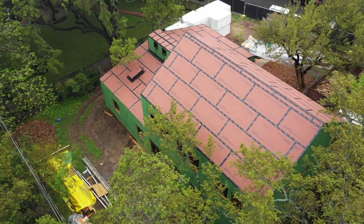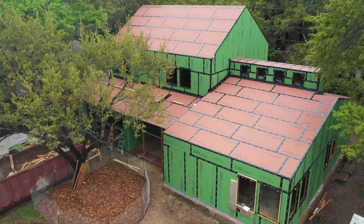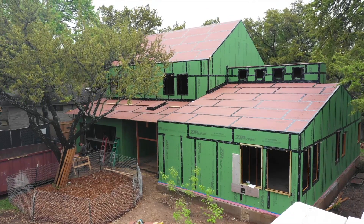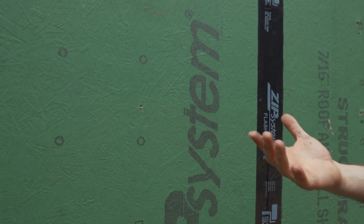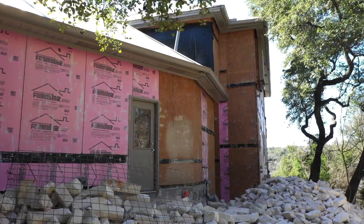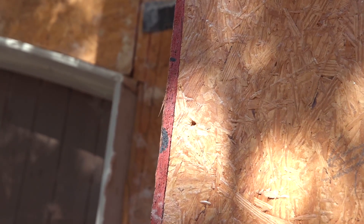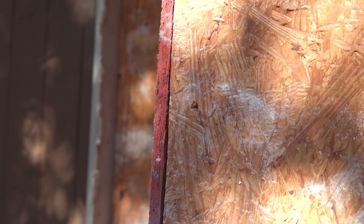What happens when we get our siding, roofing, rock, and cladding on? Not nearly as much water is going to make it back there. I also just finished a video on a house that had no exterior house wrap on it whatsoever — the builder used oriented strand board as sheathing, put nothing on top of it, and then rocked over the house. What happened on the nail holes four or five feet over the ground on that house? No difference, no issues, no water, no degradation of the OSB — because the OSB wasn't getting pounded by water.